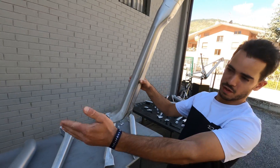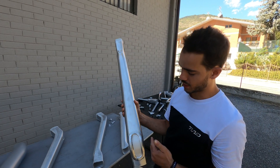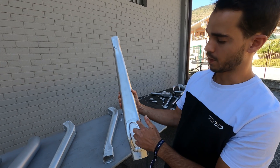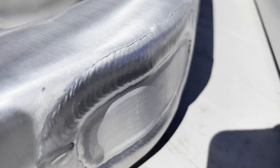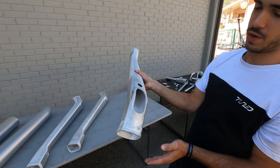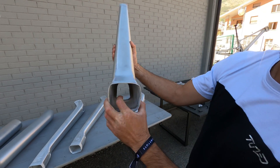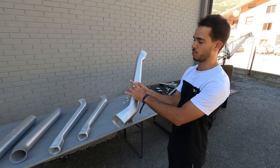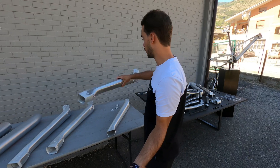On this one, as you've seen on the bike, we have a big opening to access the shock. To get this big opening without compromising the strength or rigidity of the bike, we do a reinforcement weld, then we grind it so it's flush with the frame — it's invisible. And we cut through it, so as you can see it's barely visible, and we still keep the extra thickness for the reinforcements. It's quite a smart process so we don't have to thicken the whole section of tube and gain a lot of weight.